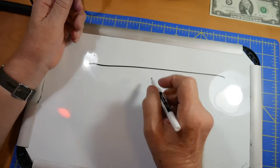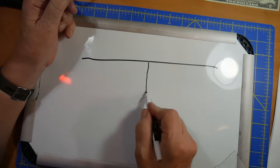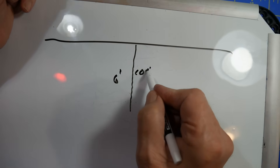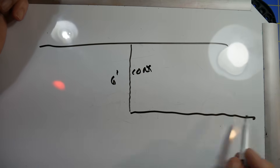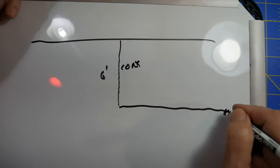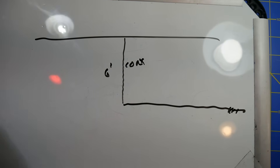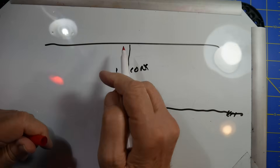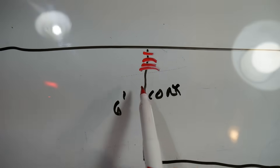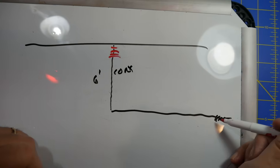He's got this attic antenna, about 15 feet long or five meters, with the wire coming down about six feet to the attic floor via coax, then running along the floor in the same plane as the antenna. He's put ferrite beads down there to try to eliminate it. One of the first things I would suggest is to put those ferrite beads up at the antenna — maybe a bunch of them. What this will do is keep RF common mode from coming back down the outside of the coax.